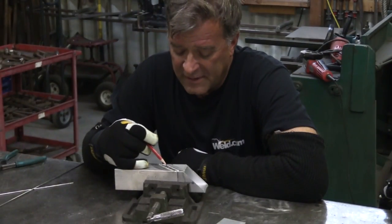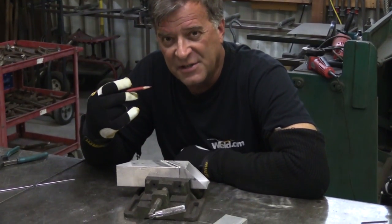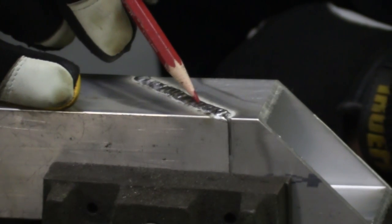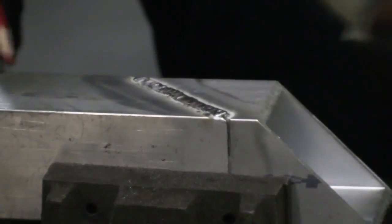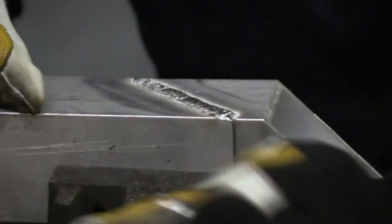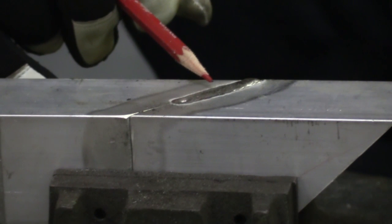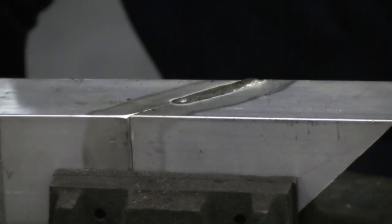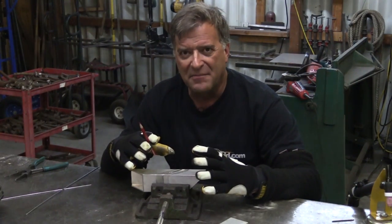Here's 75 amps — all the other settings are the same, just with the new tungsten. See how tall this weld is? Great big old bump. Now let me flip it over — see how flat this one is. So just 25 amps difference. That's how I do it: take a piece of scrap, test it high, low, closer, closer, closer — work it right together until it comes out correctly.